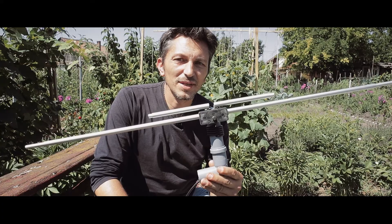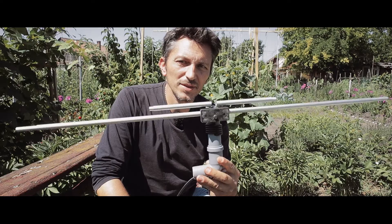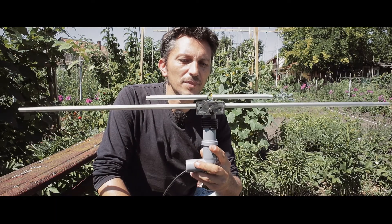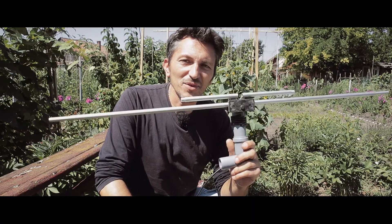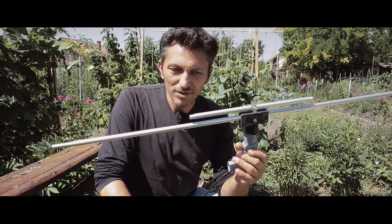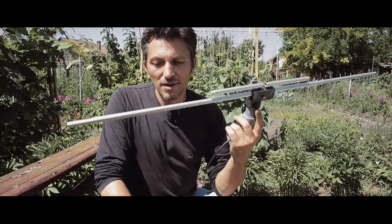It's a very simple and effective antenna — works amazingly on both simplex and repeaters on FM. I'm installing it vertically, though for SSB and CW you might need to install it horizontally. I'm really happy with it. Until I finish my dual-band Yagi antenna for satellite work, I'll try some QSOs with this one. I'm just going to check the SWR on the nanoVNA, though it's not perfectly adjusted yet since I want to do the final adjustments in the antenna's final position.